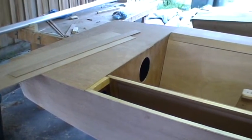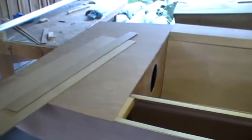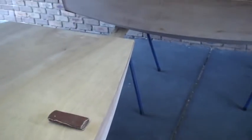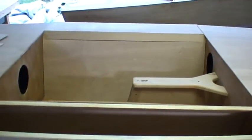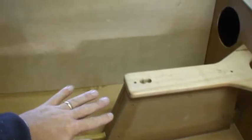Now look at attaching the deck. The deck comes out of a single piece of plywood, 2.4 by 1.2. On the stern here we've simply cut a strip off one end of the plywood, and we've actually turned that strip around so that the nice machined edge of the plywood is up against this bulkhead. We've done a similar thing with the bow. All these have occurred as they're being placed on and trimmed reasonably to shape, with a bit of a overhang that we can plane off once the deck is attached. The remaining piece is cut in half across and then a section cut off the side, so that piece lays from here down to the cockpit and then up the other side.